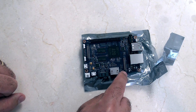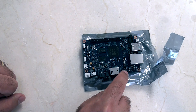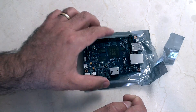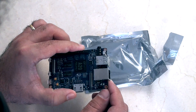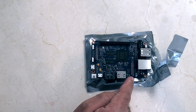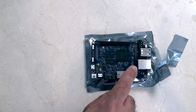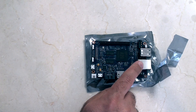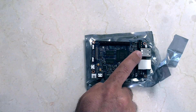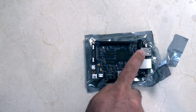This is the display interface — it's called the LVDS RGB. There's this little button here — I'll look into that and you should see on screen what it is. There's a debugging TTL UART here. And the reason I love the Banana Pis: this is a one gigabit ethernet interface, so much faster than what you're going to get with a Raspberry Pi. These are USB 2s. As I've said in a previous video, you can't get USB 3 with ARM at the moment, so this is limited to USB 2.